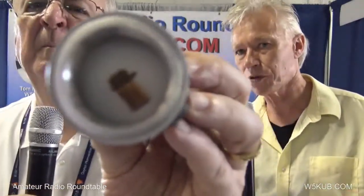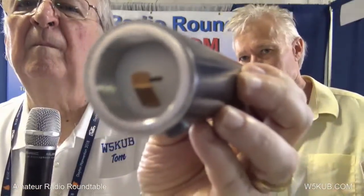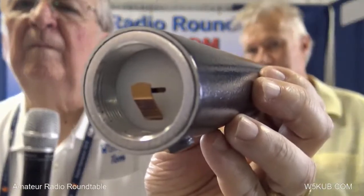And I appreciate the fact that you made note of the connector. This is an NMO connector, and you see it's a phosphobronze-style leaf connector. So you don't have the problem that sometimes you do with the very small spring-loaded style. With those, when you put any kind of wattage in it over any period of time, they can actually burn and then you lose your good connectivity. This one is much better for that. And by the way, it's all made in the USA — every single component.